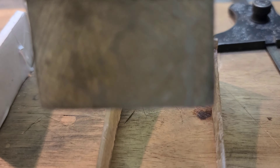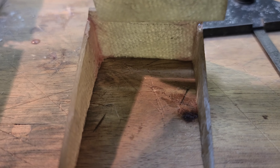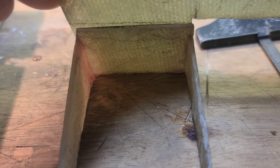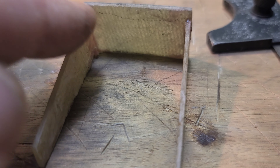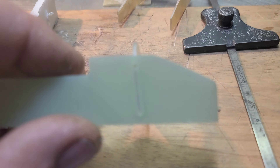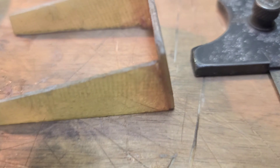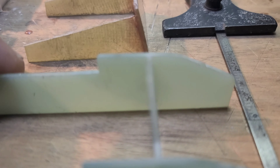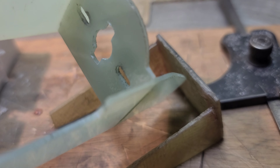What I'm going to do next is take our laminate we made, cut a piece to slide in behind that front motor plate, and glass it in — that's going to give it a little more structural integrity so it doesn't flex or break, because we were going ultra light. You could also make your motor mount with a mortise and tenon type joint on your rails, and you probably wouldn't have to cut this second piece. But since mine's a three-piece motor mount, I didn't want to go through that trouble — I'm just going to add an extra backer on the motor plate.